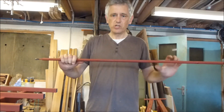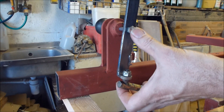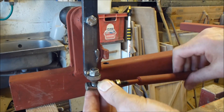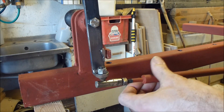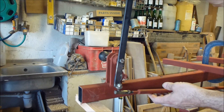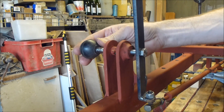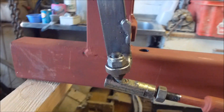Here on the back of the machine I've put a bracket to take the gear shift mechanism. So down at the bottom this will connect up to the extension rod. There's a left-handed thread going in. Forward gear is selected like this, and then back this way we eventually hit neutral. To get into reverse, which is something you don't want to do by accident, this mechanism will slide across, and then one more click it will pass that stop. So that's one little concession to safety.